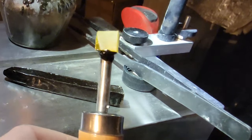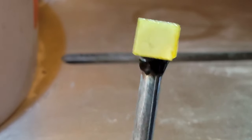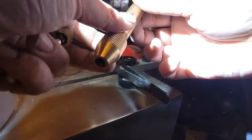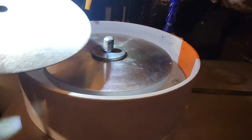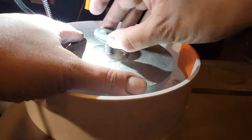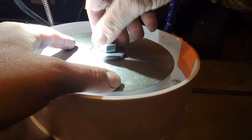If the stone is too cold the wax will solidify instead and it won't get a good bond. Once the wax has cooled a bit I examine the stone to make sure it's centered. If it was off-center I could easily nudge it back into position while the wax was still warm. Once the wax is set I loosen the collet and put the dop in, tightening it part way but not all the way so it can still rotate. I take the 270 grit cutting lap and put it on the machine, tightening it with a thick washer and nut.